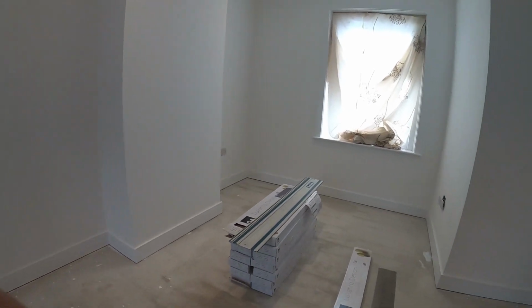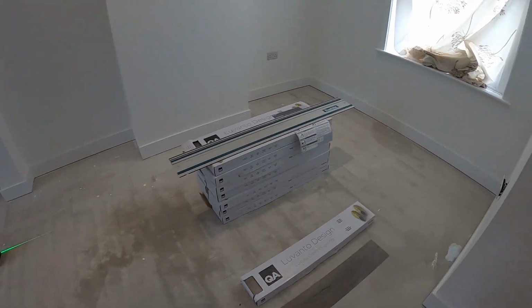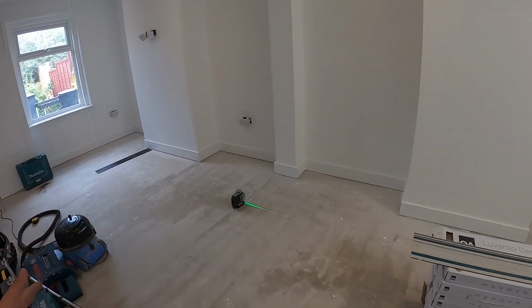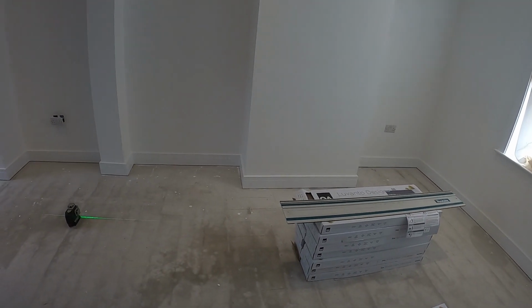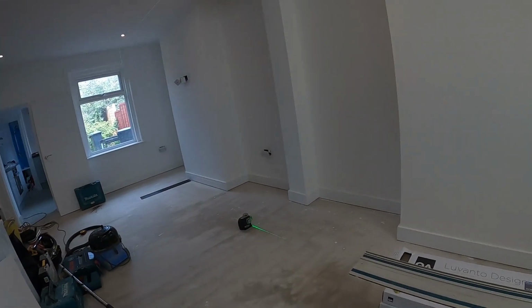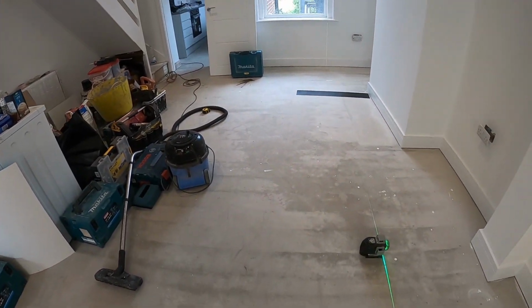In my case, if you remember, they were quite wide timber boards and they were old, so obviously dried enough. If it would be all new floor, or if you have a chipboard, that's fine too. So what I did is I've used some polymer adhesive in joints where I had bigger joints in between the boards because there were a few gaps. Then I used a renovation screed or latex, renovation latex, which has some fibers inside. There are some tiny cracks, but they always appear no matter what kind of floor you have, either it's screed